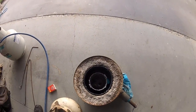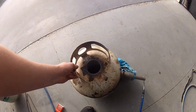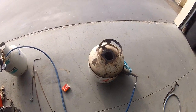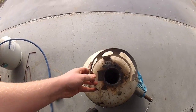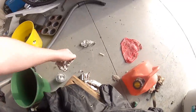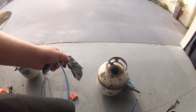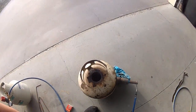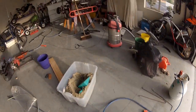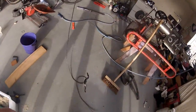There you can see the flame shooting around. I'll place a load on top and let it heat up. I'll chuck some scrap in it - this piece is from old castings that I've done. I'll let them melt down, and once they've melted down I can add the bigger pieces from my last casting, or use some other scrap that I have.